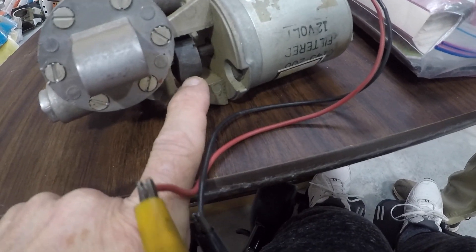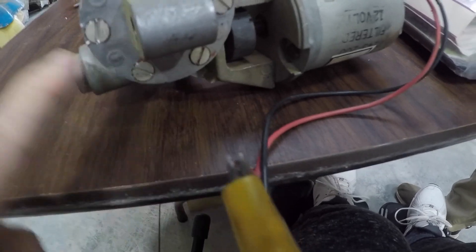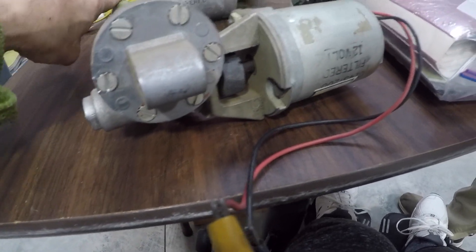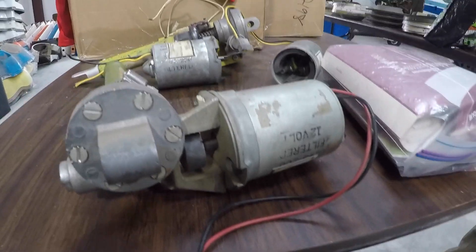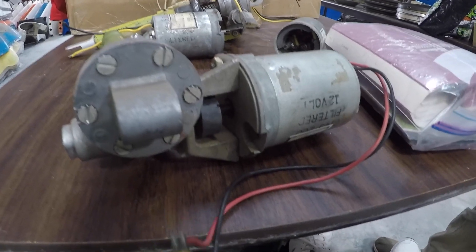The motor right here turns through a rubber connector, so if it shears it will just pop out. It drives through a worm drive which drives this worm gear, which deploys your flaps. So that's how a flap system works.